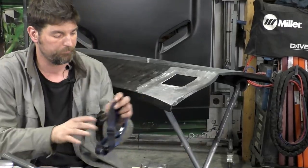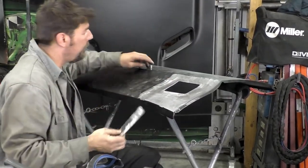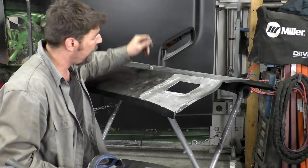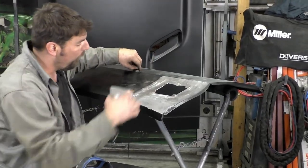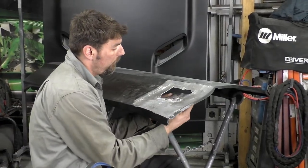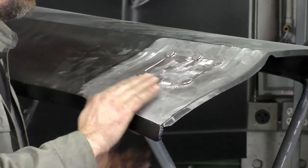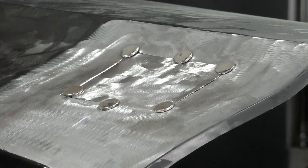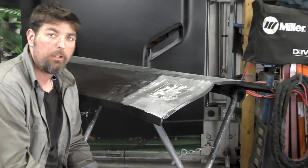A lot of times I'll use a flap disc — they seem to work a little better in this area. We got basically the mill scale off of it; that's going to make it weld a lot easier — I recommend doing that for a better product. We're going to take these earth magnets and put them on the four corners, probably two in the middle. For their size these are really strong. We'll come through the bottom — in general that's a pretty nice fit right there. Now let's get some acetone and wipe everything down really well before we weld, clean up our welding rod, and go over some of the welding setup.